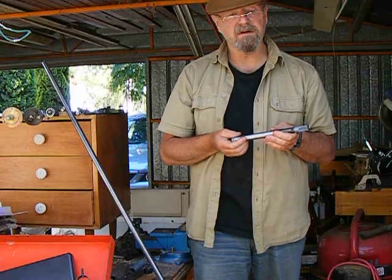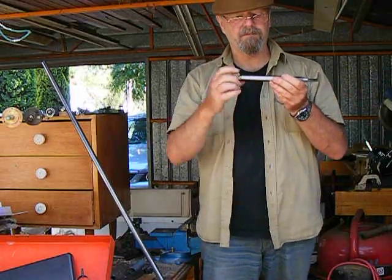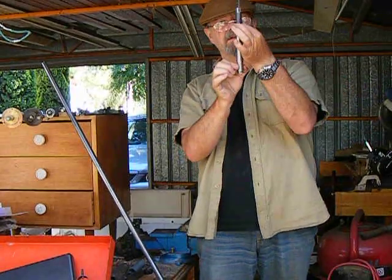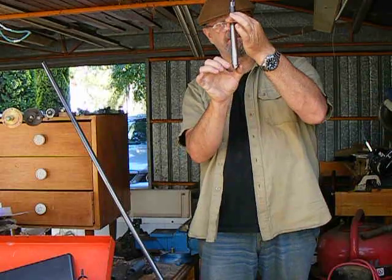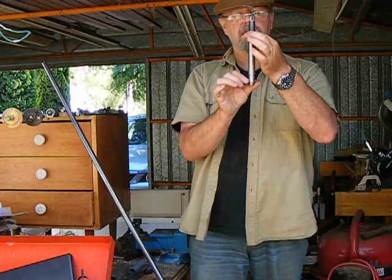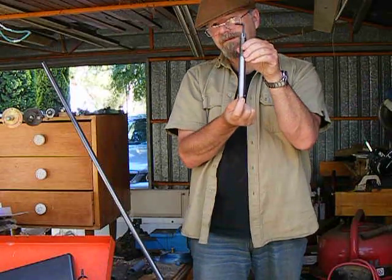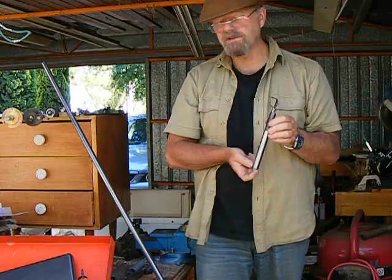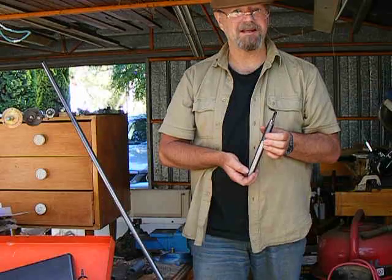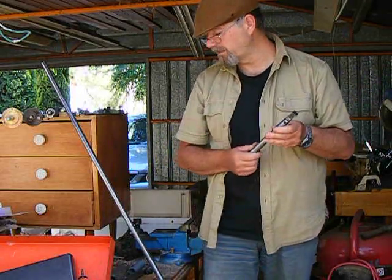Some sleeves are actually very, very hard to get out. If you get a bite on both sides — which is the advantage of having it a little bit sloppy, so the force distributes and lands on both dogs — then you've got a maximum pull strength, a design strength of 1.4 tons pull on this tool. If your sleeve doesn't come out with that much pull... but it will. That's a lot of pulling force for only a 20mm, 90mm sleeve.